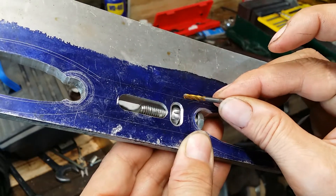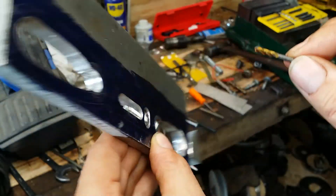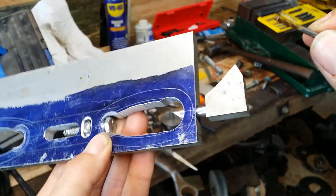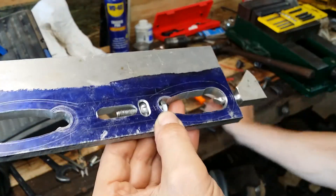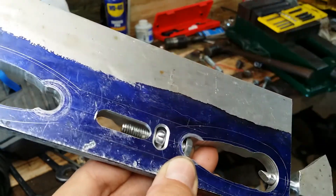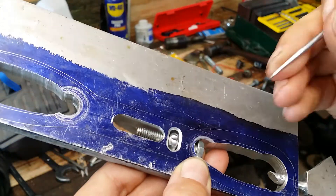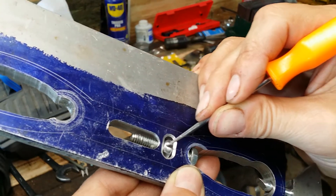I think I need to use a smaller bit and rotate farther on the rotary table by quite a bit, to get it to come down farther on the sides. The eighth-inch bit will allow me to come farther down.